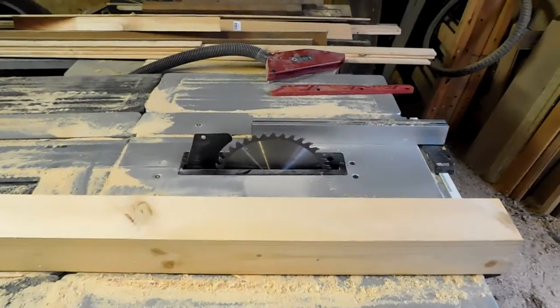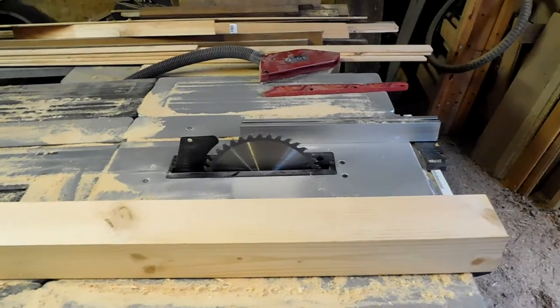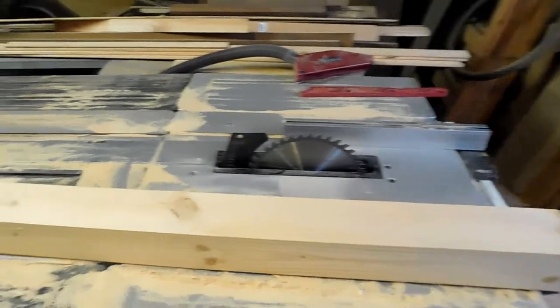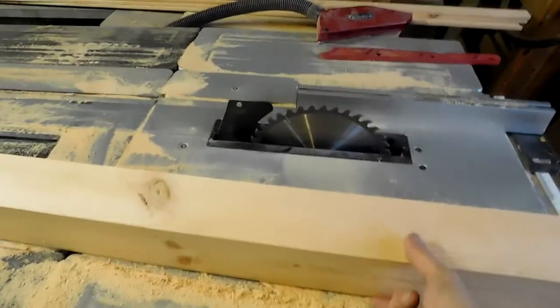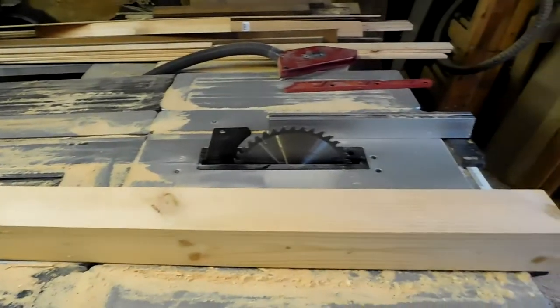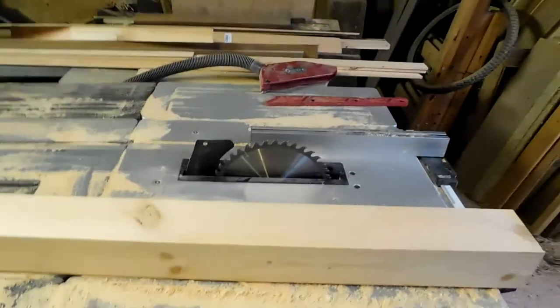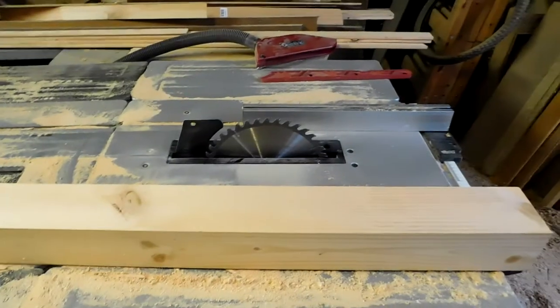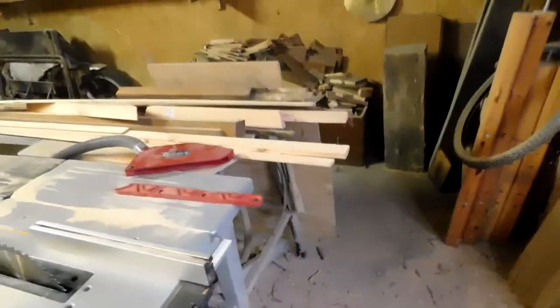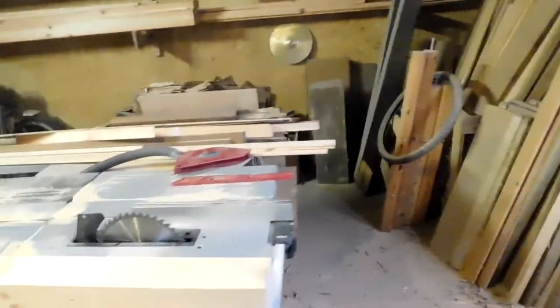You might remember my saw story from a couple of videos ago. This is it here, sat there. Look, I've just sawn the floor beam for the number 8, so it has to be 8 centimetres deep, so I've taken that 9 centimetre square, 3.5 inch square, just trimmed a bit off of it. I said I was going to invest in a decent blade for it, and I did that. Years ago, for this old burnt out saw that's under that stack of wood there, I bought a blade on eBay, and I was really very pleased with it.